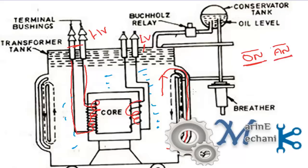As we saw in that video, we have a drain valve at the bottom just to replenish oil or drain out and flush the tank and check for internal corrosion. And the conservator tank on high power transformers has a diaphragm so that air doesn't come in direct contact with the oil and the transformer circuit.